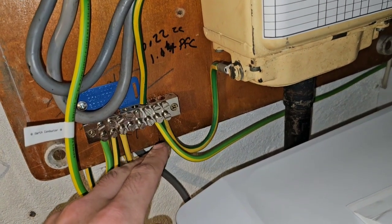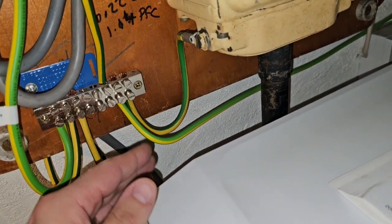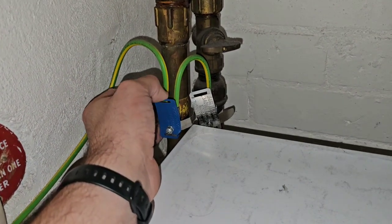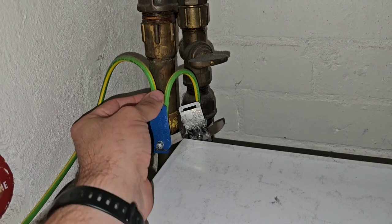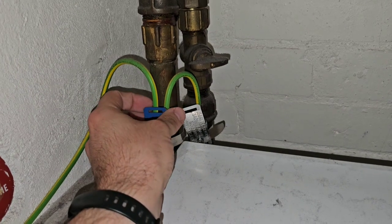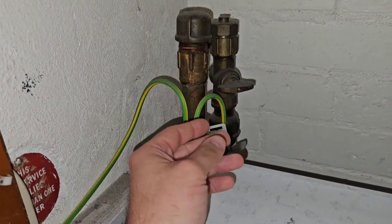What you may find is 6mm bonding conductors on a PME system. This would be coded as a C3 in my opinion, unless you had signs of burning where current was being diverted down a separate earth path — for example, a bad PEN conductor causing the 6mm to get hot. It may not be ideal as it's not half the size, however when it was installed it was probably acceptable. If it's 6mm with no signs of burning it can be noted as a C3, but if you're upgrading the board you'd have to upgrade the bonding as well.